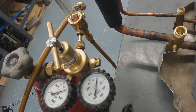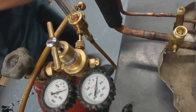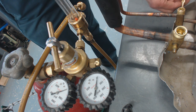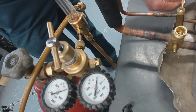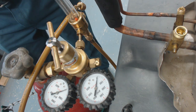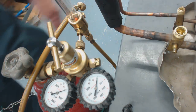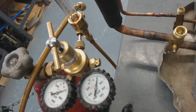We're going to put the Schrader valve back in on this side. And now we're ready for our pressure test, up to the PSI of the evaporator coil design pressure — anything below that will be fine to pressure test with. That's how you do it. Hope you enjoyed it, and see you next time at AC Service Tech.